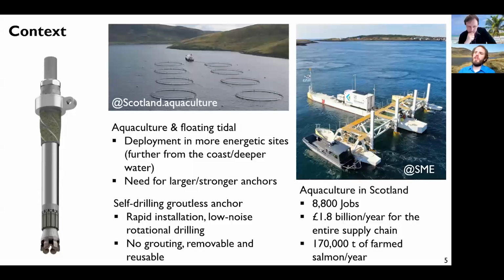So I think this is the drilling bit. It's self-drilling actually. So this is rotating, and you have the teeth here. You just drill the hole up to the desired depth. And when you reach this depth, obviously you stop drilling and you move this part. I think this bit is going up. You have a nut there. So you just lock the anchor, and while locking it, these fingers are designed to be extended laterally by this bit moving upwards. And this is what creates the locking of the anchor.